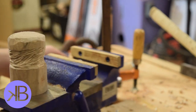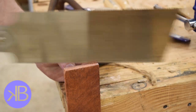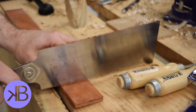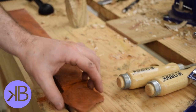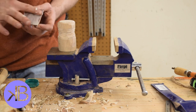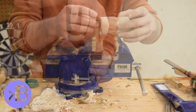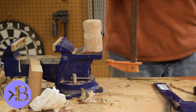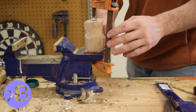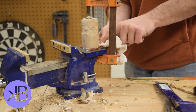At this point, most of the carving is done. Next I re-sawed a small piece of padauk to serve as the face of the tamper. The first one I had made, I used an end grain tamping face, and it tends to stick to the grounds a little bit. So this is why I'm gluing on this little slice of face grain to the bottom. This part of the vise was pretty handy for keeping things flat when I was gluing this together. Since I was using Titebond, I could just clean it up with a paper towel and a little bit of water, and save myself some work later on.